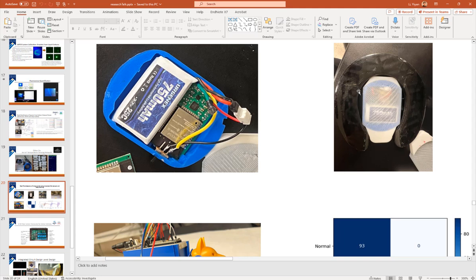So that means it has to be low power and it has to be 3.3 volts, because one cell LiPo battery is providing what? A very good interview question. That's why Dr. Carlson's lab is really good, because it's teaching the same thing I'm teaching. So what's the voltage for one cell LiPo battery? I mean, this is not common, but you should know as an undergraduate in electrical engineering. 3.7 volts, one cell, it's standard. 2 cells, 7.4 volts. 3 cells, 11.1 volts. Standard, okay? No changes. Interview questions. If you don't have the room, you can only use one cell.